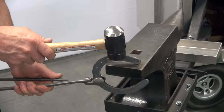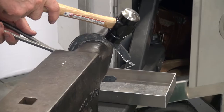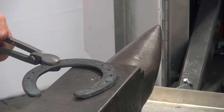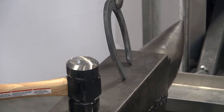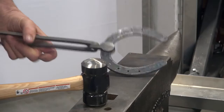On this branch, I need to straighten it up in this portion right here. I can go to this end of the anvil, straighten that up, and then I need it to curve that heel in more. I'll have the same radius under the shoe so there's complete contact. Just beyond that contact, I'll head over the edge. Again, flatten the shoe. Every shoe has to be adjusted for every hoof.